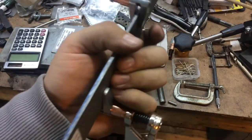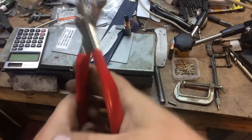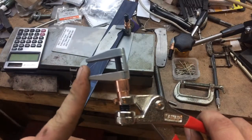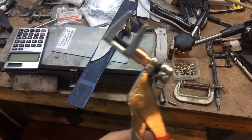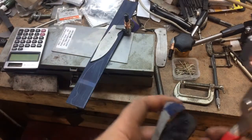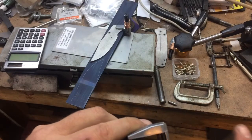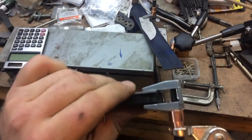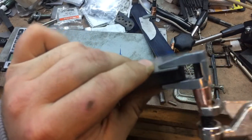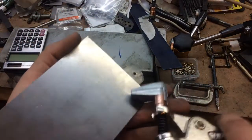Now, due to their lower profile and smaller size, they are a little bit more limited on clamping capacity. These are about an inch deep — you get maybe about half an inch, possibly 9/16ths if you really squeeze on them. But for knife making, especially slip joint making, that's usually more than enough. Here's a back spring and two scales — I can even fit probably a couple of liners in here if I needed. I've got plenty more room there for another liner. I can kind of hold all that together and drill it if I need to. And when I'm done, it just comes right off and doesn't leave any evidence of having been there.